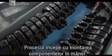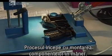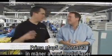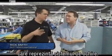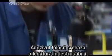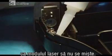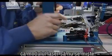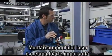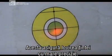The manufacturing process begins by installing the parts inside the handle. Step one is taking a laser module and aligning it into the housing so that it's aiming where the darts are going to go. The epoxy this worker uses creates an indestructible bond, ensuring that the laser never moves. Mounting the laser sight is a critical step because it ensures that the probes will impact the target accurately.